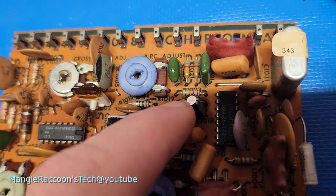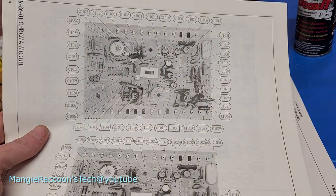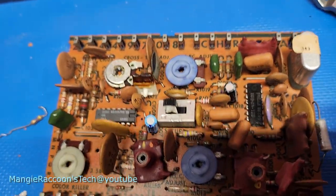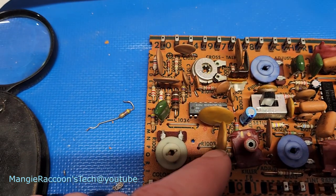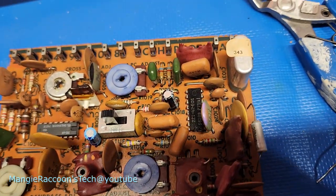I got this capacitor moved from over here into the spot the schematic says it's supposed to be in, and the value is the same. The problem is the layout on the SAMS is a little different — components are in slightly different spots. So I'm really hoping that when it says C15 at 10 microfarads it's the same circuitry, just a different layout. Anyway, C18 is now in its right spot. These are the right caps, they tested fine, and I put them in their right spot. I can't find any place that's missing a resistor, so I don't know why that extra one was stuck in there. I'm just going to pop this board in now to see what happens.